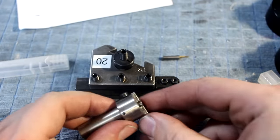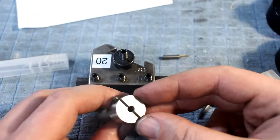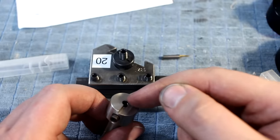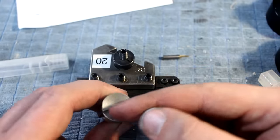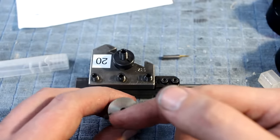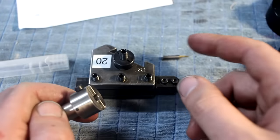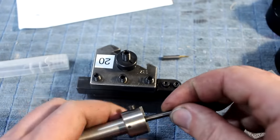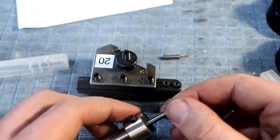And for grinding tools in that system, I made this adapter for the tool and cutter grinder. It has a step milled in here for the diameter, so I can use the alignment finger of the D-bit cutter to get my orientation. It has the same cross pin that allows me to orient the tool in here. Then I'm ready to grind.